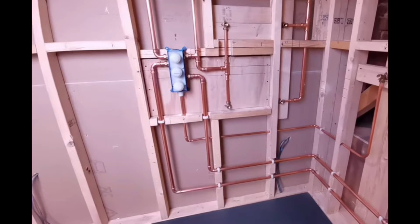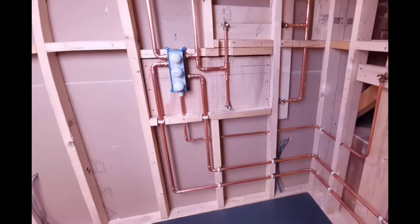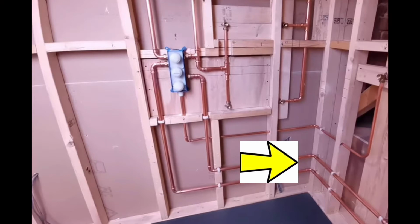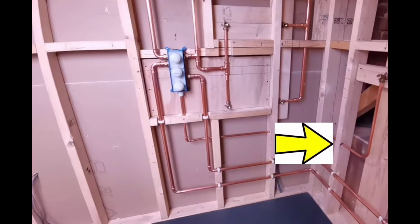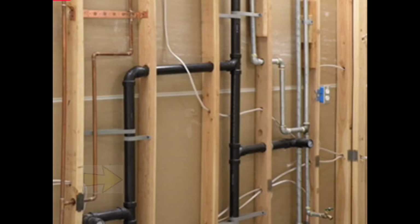That's because the depth of a roughly cut stud is 2 inches and a smoothed out stud is about 1.5 inches. So let's think about what we're doing. We've shown previously that vent and drain pipes could be anywhere between 1.5 inches, 2 inches, 3 inches and 4 inches. And we've also got studs here that could be anywhere between 1.5 inches and 2 inches. And we've also got cold or hot water pipes, copper or metal pipes, as well as timber stud walls that are over 5 inches. Then it is absolutely imperative that you have stud finders or pipe and cable detectors so that you avoid drilling through a water pipe or a metal pipe or a conduit pipe that's got wiring.